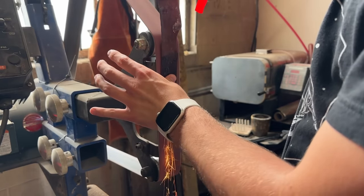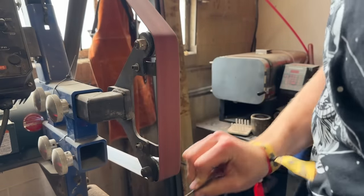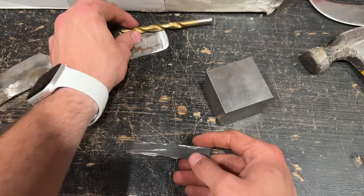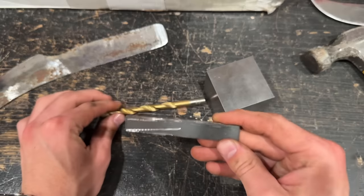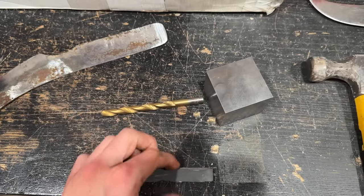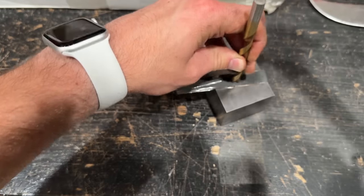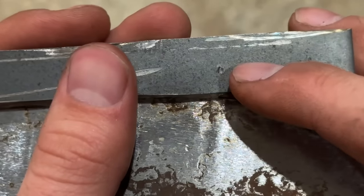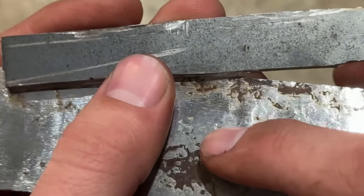Let's get off all the gross crud on the outside, then we can perform another hardness test. Here we have the most accurate way of testing hardness: hardened steel drill bit, mild steel, case-hardened steel, hammer, tungsten anvil. It's a lot deeper and wider on the mild steel than it is on the hardened steel.